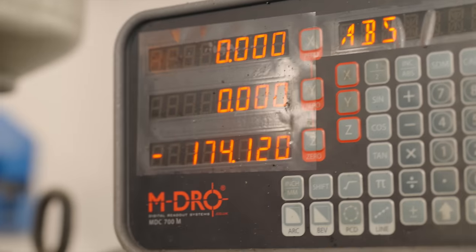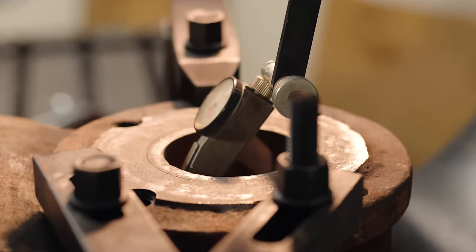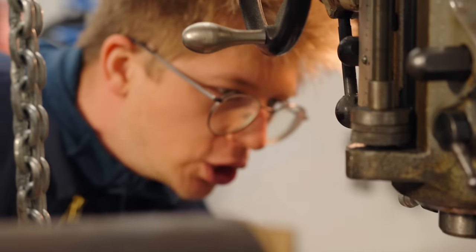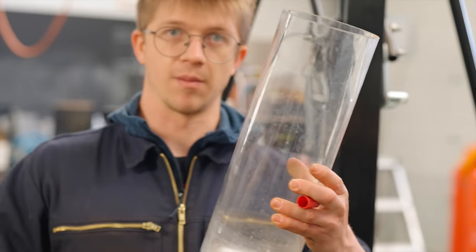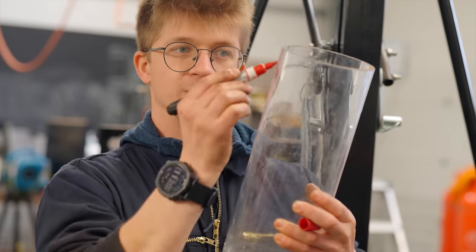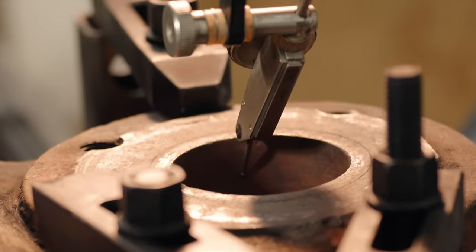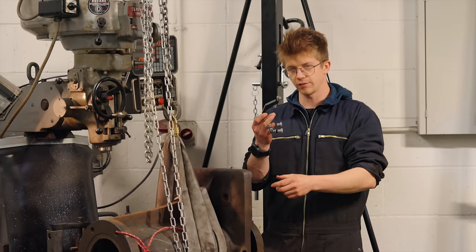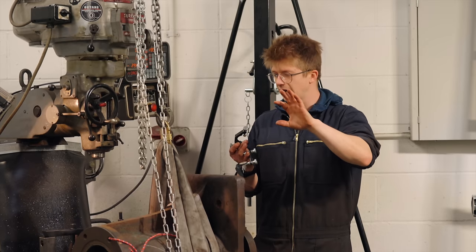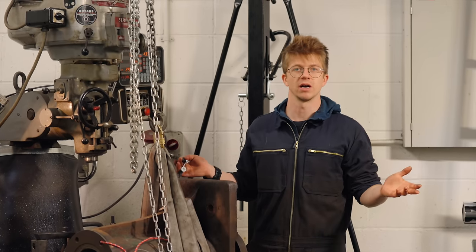So now I have zeroed the very top of the hole. We'll see if it's skew-whiffed and tilted. Hey, that's pretty good — that could have been so much worse. And that looks pretty good on the other side too. This little valve piece rotates around the middle of that bore. What I've just found is that the top area from two angles is perfectly straight, but as we start getting to the middle third where it's been rubbing, it really hollows out a good bit. I can't get to the bottom because the bar won't go long enough. At the top third it looks straight up and down and centered. I'm feeling relatively confident it's a good time for a skim pass with a boring bar — that'll tell us a bigger story of how close we are.